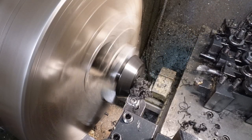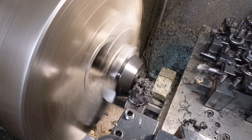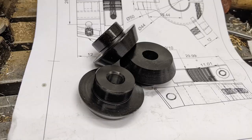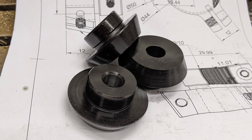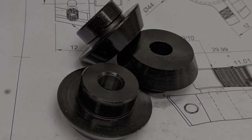Now for the third part. I've already tapped this part, but I need to drill the clearance to 12mm, then face the part off, and then drill the clearance hole in the final part, and face it off, and then we're done. Now of course I've got almost no way of holding these pieces to do the machining of those ears, so part two of the video will be making a mandrel to fit in a collet chuck on the rotary table. Watch this space.